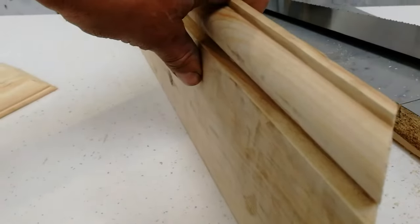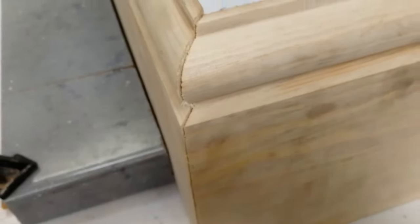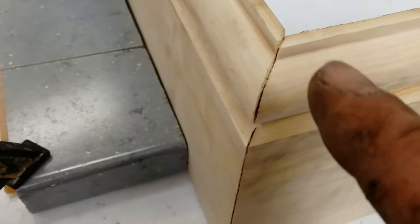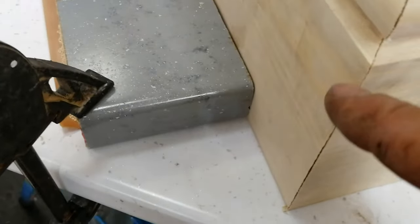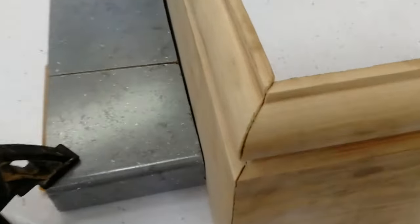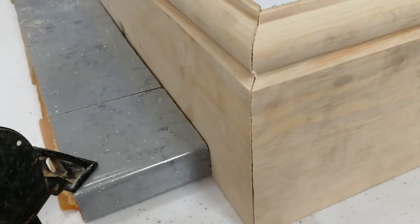As you can see, I've cut it at 45 using the method I just showed you. I've cut another piece at 45 degrees the exact same way — just cut through the reflection down to the profile, then cut the rest using the saw as a square. A bit big on the back, but it doesn't matter — you're not going to see it. That's all you're going to see, the front edge, so don't be too particular.